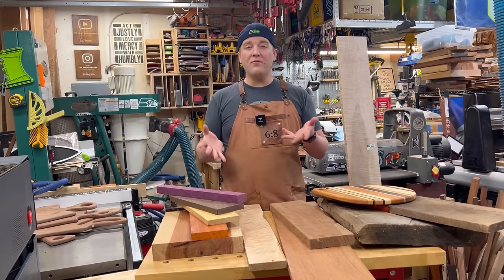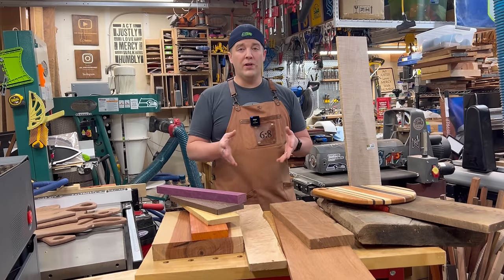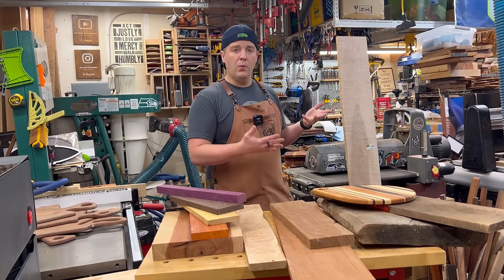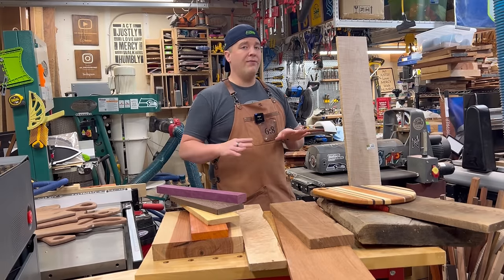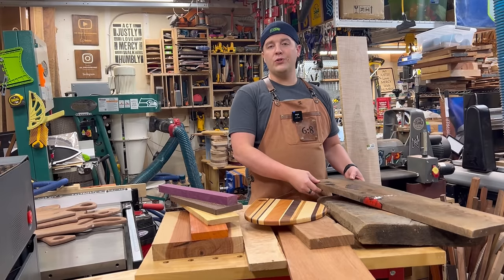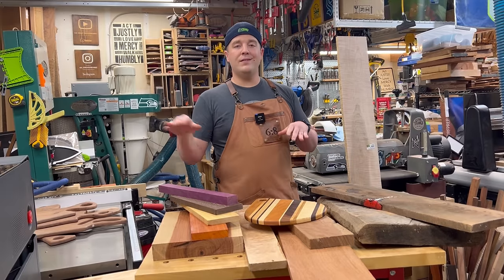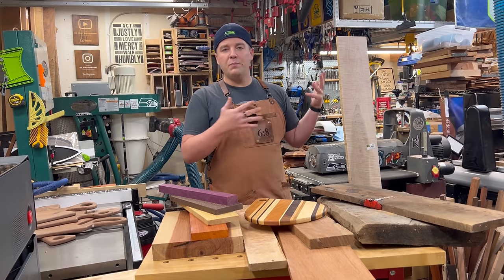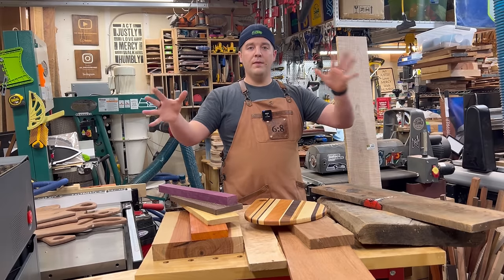Wood 101 also covers where to find and buy wood, including cool exotics. Something to consider when buying wood: you can buy wood that's already surfaced, like this curly figured maple from a lumber yard or woodworking store — I don't have to run it through a jointer or planer. However, if you're buying from a local sawyer or sawmill, it might be uneven and you'd need to run it through a jointer, CNC, or router sled first. All of these boards I'm cutting up are pretty much already surfaced.